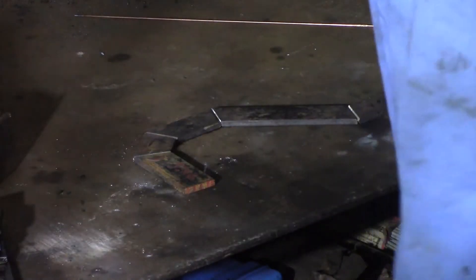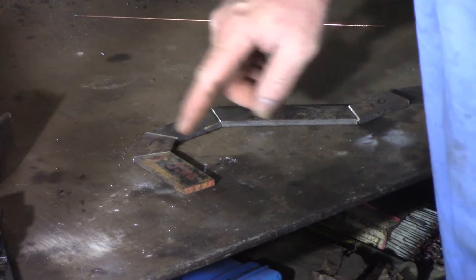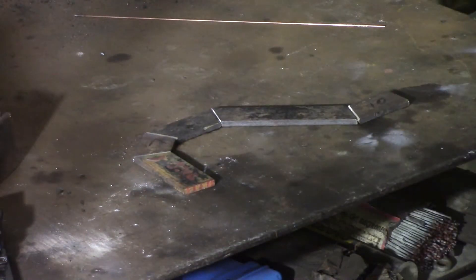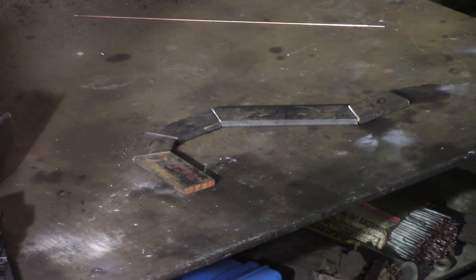When I designed this handle for the EasyLift, my idea was to cut it out of a piece of sheet. I don't have any 6mm sheet around, so I've cut several angles and I'm going to weld it together so it comes out roughly the same shape as I would have drawn anyway. A little bit different mainly because it's easier with the angles to do it this way. Probably doesn't look as nice, but I can live with that.